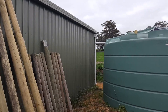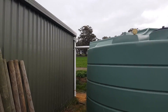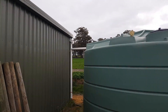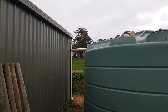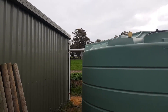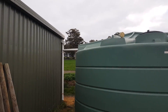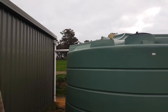My gutters — I might just mention down the end there — I've got a really good system. You can see the long pipe hanging down; that's a sediment trap. Any rubbish that comes off the roof — and I do have birds on the roof — goes through that filter system. There's mosquito netting on there so mosquitoes can't get into the tank. The sediment goes straight to the bottom, and I let that go maybe once a year. You can have a tap on there; this one's got a drip system. I've got rid of that and it taps away — you can just control what you're doing. That's a neat little gadget.